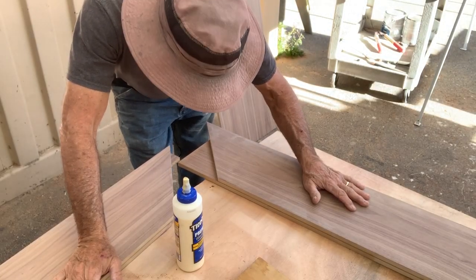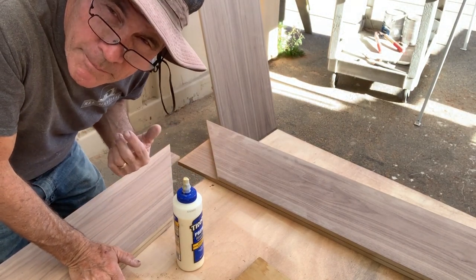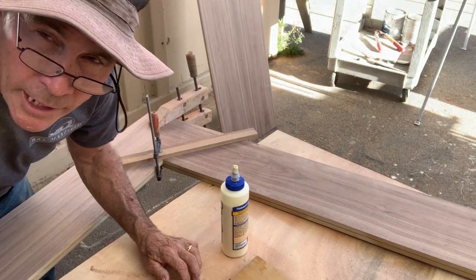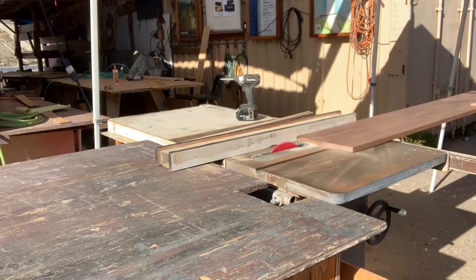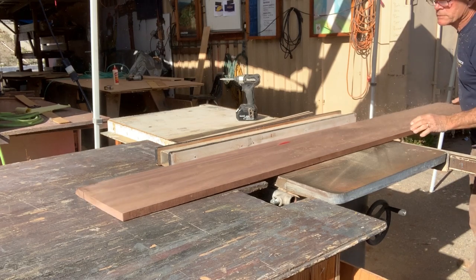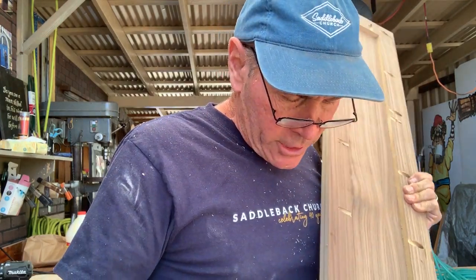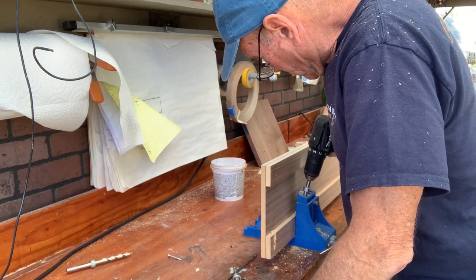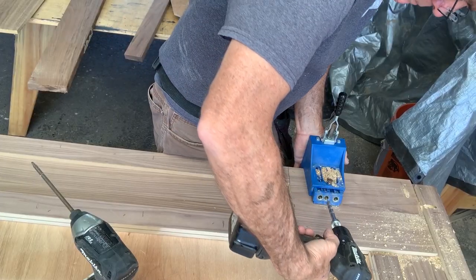It's time to put these two pieces together. I made a little piece that's going to lap into the other one, so I'm going to put a bunch of glue on there, clamp it up, and staple it from the bottom. I'll let this joint set up and dry while I go cut my edges — two inches wide out of this beautiful piece of black walnut. To minimize nailing from the outside edge, I'm going to use pocket hole screws on the back side, and hopefully attach that edge tight enough so it's seamless on the outside.